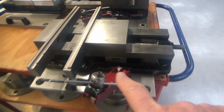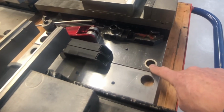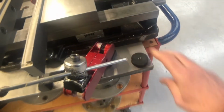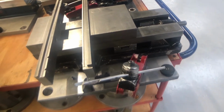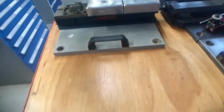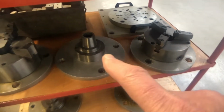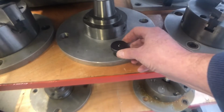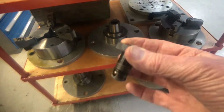These are some conventional vices commonly used in milling, but same again, they're fitted onto these subplates. So we put these subplates on, put the bush through, locate onto the table, and we know exactly where they are within probably about 10 microns. This is a pilot vise that's been fixed onto a subplate, and down here we have subplates for the 4 axis. So even the collet chucks are all fastened on using this same system of just pinning them on using these ball locks.